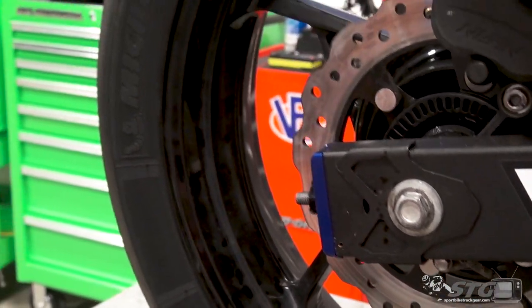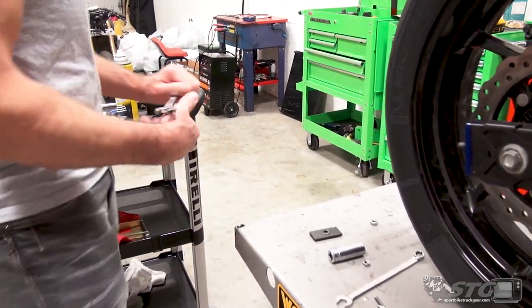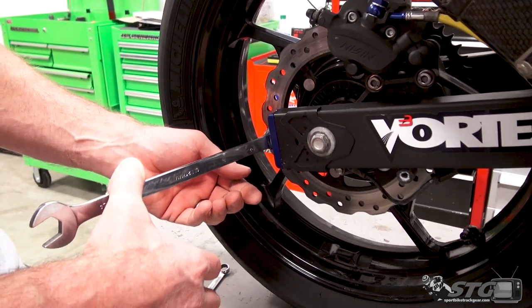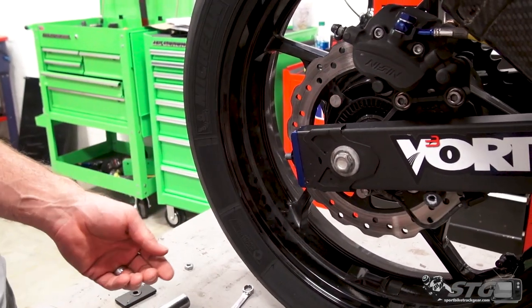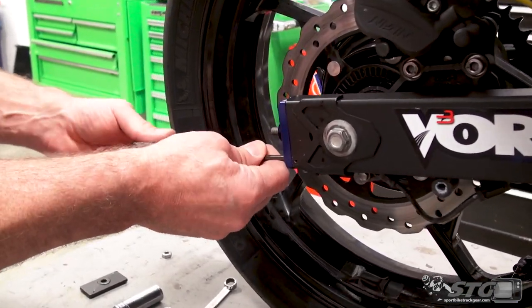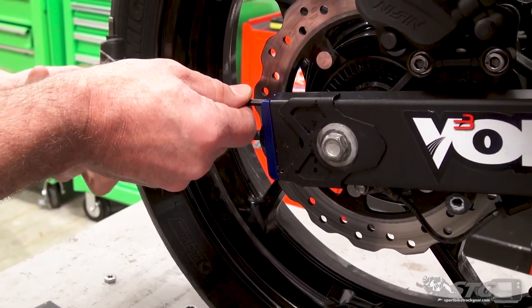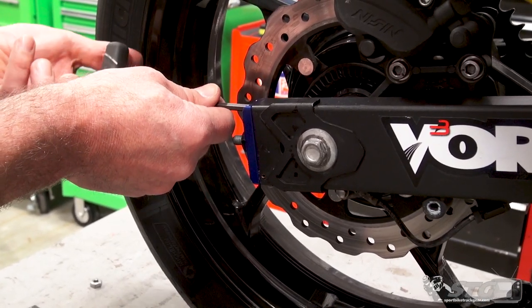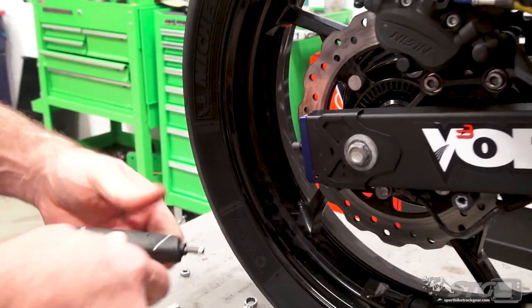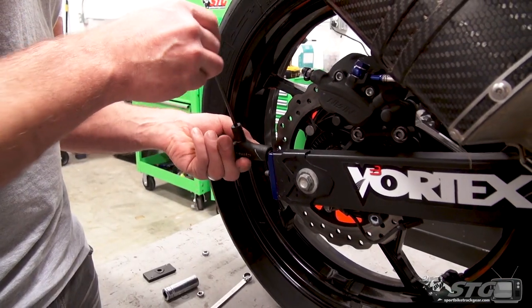This fits really nice. Using a 17mm wrench on the nut that's fixed in place — captured — it's going to put just a little pressure on it, not a lot. It doesn't need to be super tight. Now take the 5mm T-handle, just snug that up and then move to the other one. Don't put any real torque on it yet — you want to do that evenly from side to side. Once you have them both to the point where they're starting to expand, you can then torque them evenly.